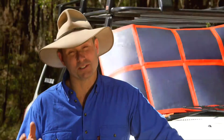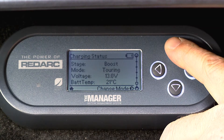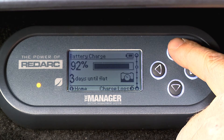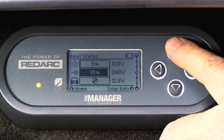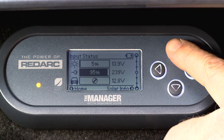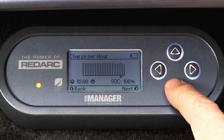One of the most impressive features is the remote battery monitoring. It gives you a wonderful array of critical information about the health of your battery. It'll show you the voltage level of your battery, the temperature around the battery, how many days of charge you've got left, the amp hour draw for every second of the day. It can even tell you where your power is coming from — a mix of solar, AC or DC with two sources used — and there are even various logging capabilities telling you the state of charge or solar inputs.